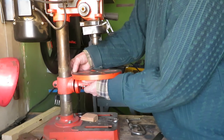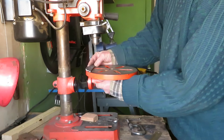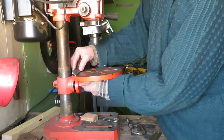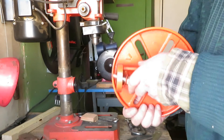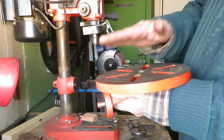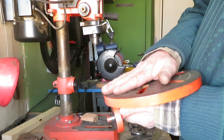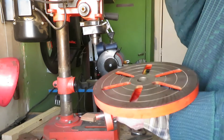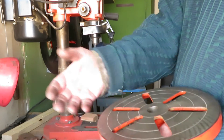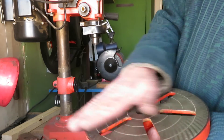For this drill press that means five millimeters — we have to remove five millimeters from there. The problem is that this material here is four millimeters thick. So if I remove five millimeters from the surface, I will have holes, and that is going to weaken this table. It's not possible to machine this table to remove that much material. If you have to remove more than two or three millimeters from the table, you can't machine it, because that could simply ruin the table.